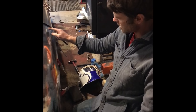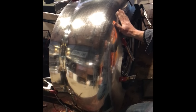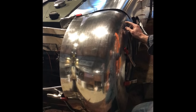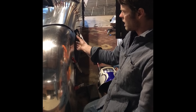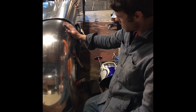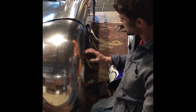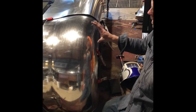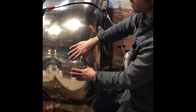Now we've got the panel welded up with the outer section here. I mentioned earlier, as I wheel the panel, I look really closely to see if there's any hairline cracks because it does get thin. And we had a couple sections that we just came back and added some filler, and then I just hand file it smooth. And then I go put it back through the wheel again to make sure that everything is holding up and there's no cracking. And then give it a final wheeling to kind of bring it into the shape that we have here. And this is really getting close now to where we want the final shape to be. It's so close that now we're ready to cut our headlight bucket.